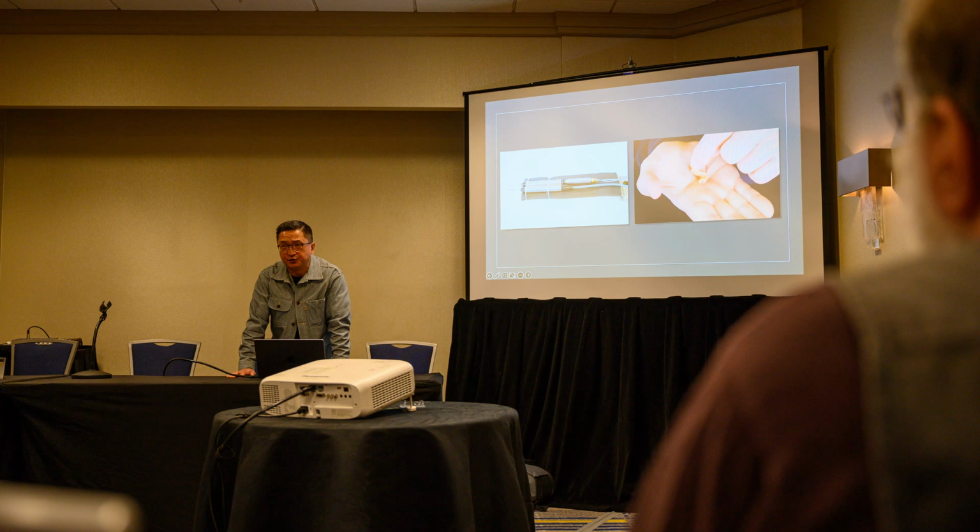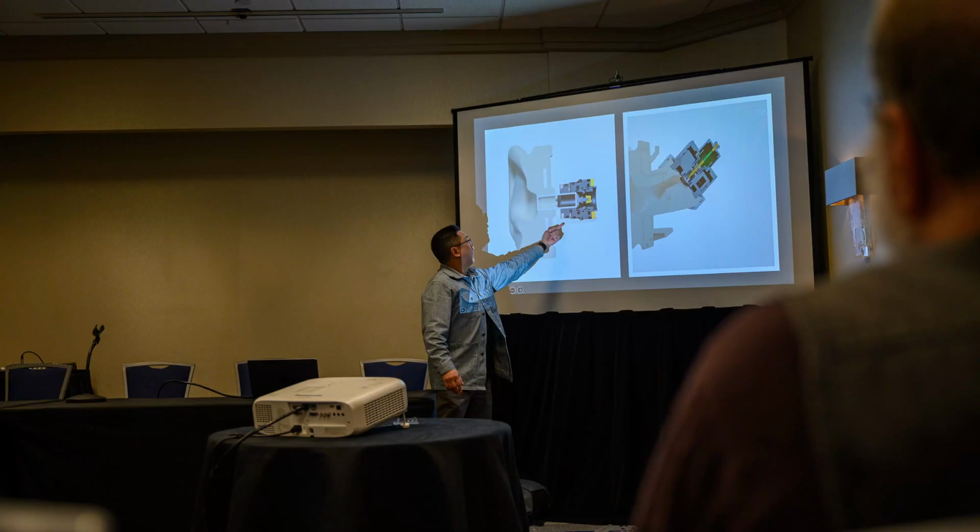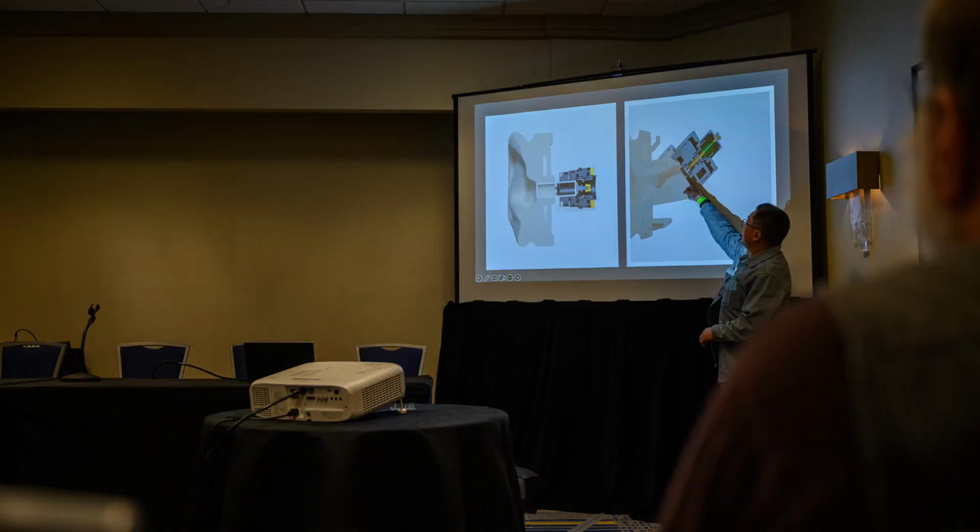Now the studies for it, I did want to mention this. Not only that, to get more realism, more accuracy above 10 kilohertz, they actually had to redesign an entire microphone. They couldn't use the half-inch microphone they've been using. So they had to design something that matched the human eardrum. And the other thing, if you look here, what's really interesting is the volumes I was telling you about, those branches, they're in front of the microphone in the 711, but they are not in front over here. That way you can have the terminus or the end of the canal being there.